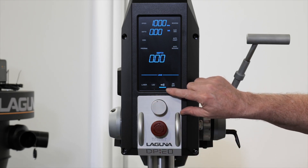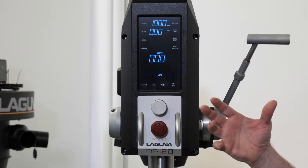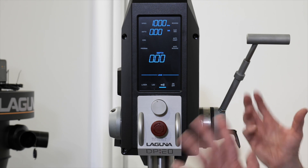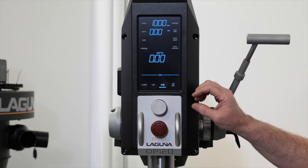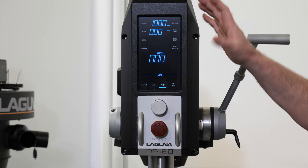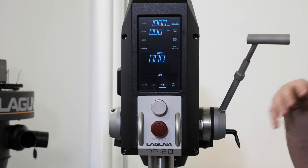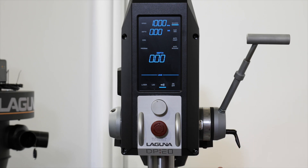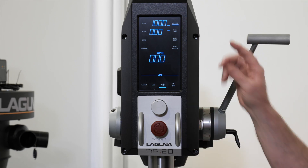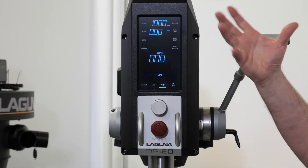The tone button can be turned off so you won't hear a tone when pressing each button. The default is on, so it'll always come back on when you restart the DP20. One of my favorites in the top section of the screen is the reverse function — press the icon and it turns on reverse mode. The default is forward for standard drill bits, but if you have left-handed drill bits or other accessories requiring reverse, this will spin the spindle in the opposite direction.